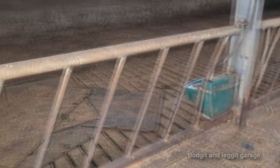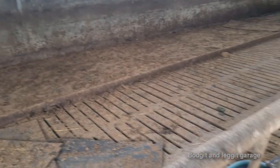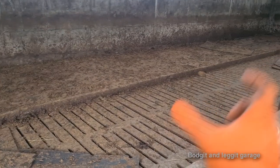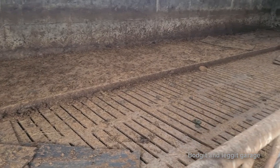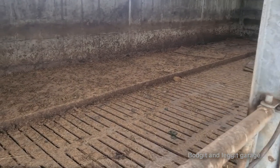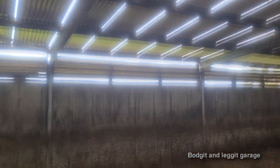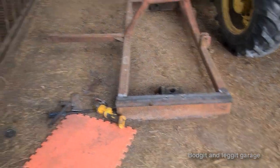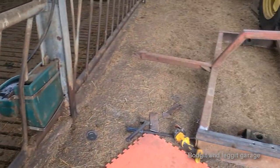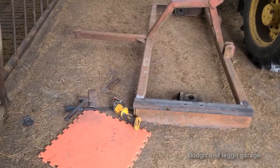I finished most of my grinding, but I just had a kind of a scary thought. The most dangerous job - if not the most dangerous job on any farm - is dealing with the slurry, because there is a lot of methane under there. This is a bomb. When people agitate it and they don't have the doors open, you can walk into this place and literally instantly drop. If you're in here for a few minutes, you're dead. That's why it's all ventilated for methane. And here's me been grinding, sending loads of sparks all the way in and around here, which is seriously dangerous. I just literally thought of it and I've more or less stopped now, but I still need to weld it.